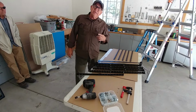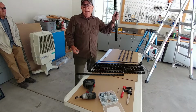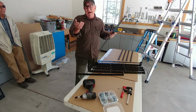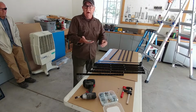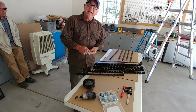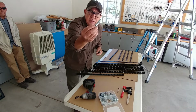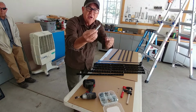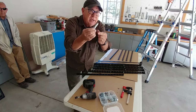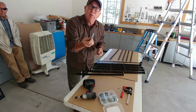All right, now that we have this set of hardware done, the next thing we're going to do is put the brackets that attach to the ceiling of your garage. Now, Fleximounts has provided two different kinds of fasteners depending on your type of installation. If you were doing a solid concrete ceiling, you would need to drill in and use these wedge type of fasteners that as you tighten this wedge unit spreads at the top. It's a quite durable and strong attachment, but we don't have that.